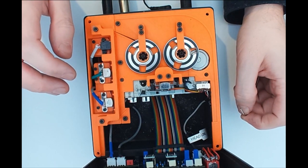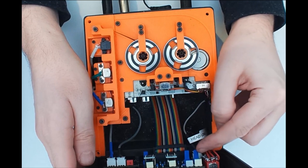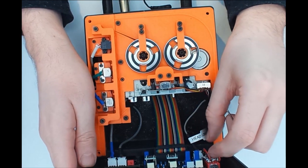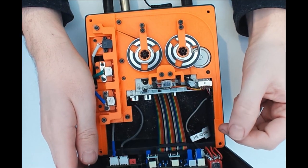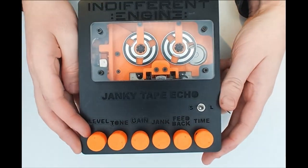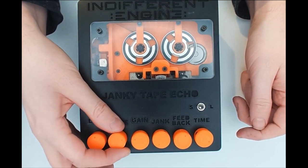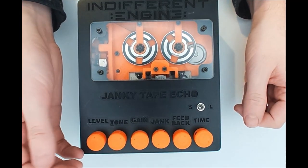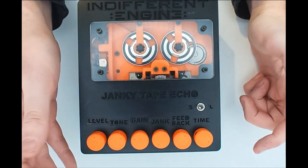I'm usually happy if we're getting a nice strong signal — I take that as a win. You can also adjust the treble and bass controls that feed the signal on the way into the tape. A common thing to do is boost the treble control all the way up, which has the effect of reducing noise. If you're boosting treble going in, then to get the same sound coming off tape you'd roll the tone control down a little. As you saw earlier, that reduces the noise. So by boosting treble on the way in and rolling some off on the front panel, you're reducing the noise while keeping the same equalization of the guitar signal.